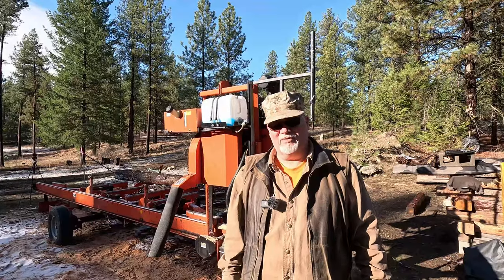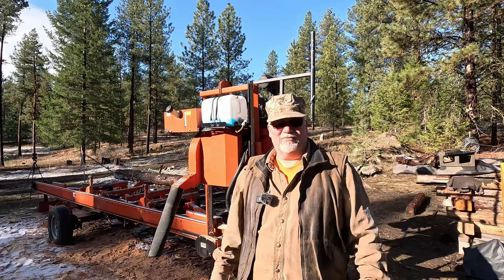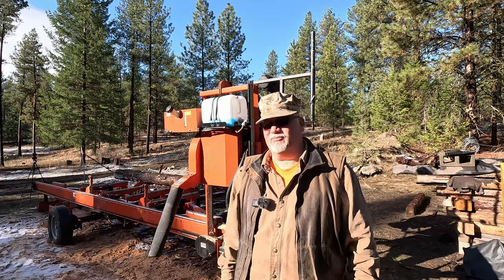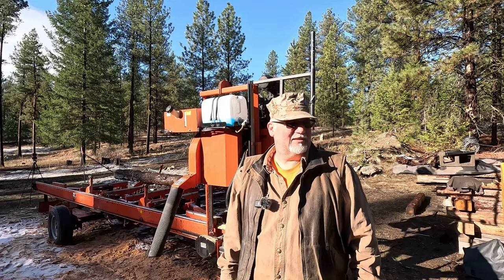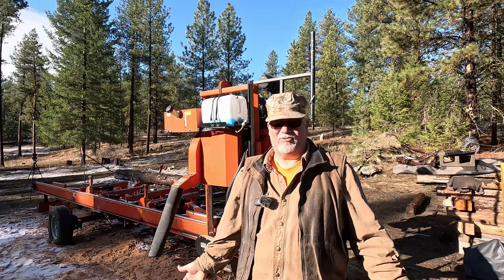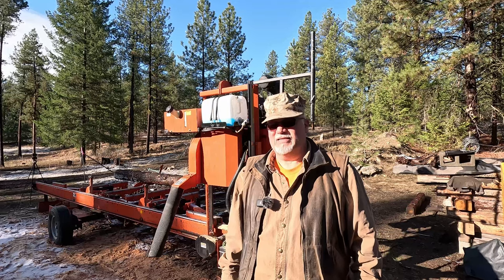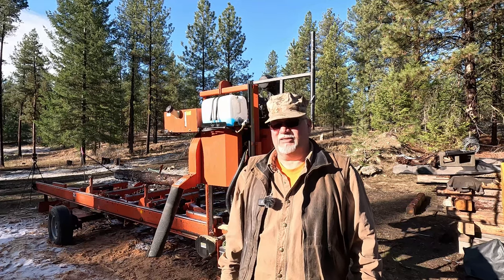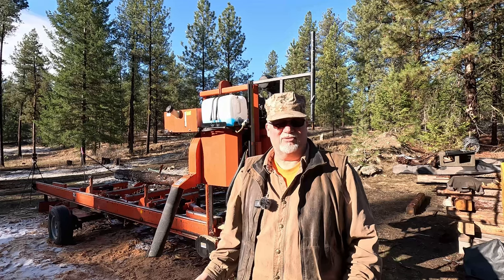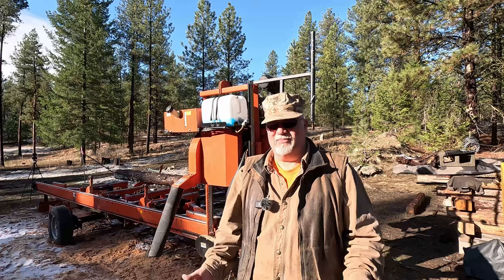Well, not a good sign, folks. I got my little solar panel on there and it's brought the voltage up from 11.08 to 12.09, so it'll bring it up. But I'm kind of concerned. Brand new alternator, light was always green. Everything seemed to be doing fine, but that battery should not be drained like that, not when the engine's running and I'm not using the hydraulics. So the fact that it drained it that much suggests that battery's not holding the charge if it's trying to give it one.